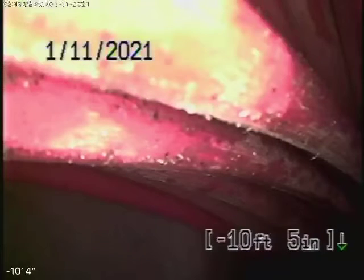We're going to pause and look in the back. It's all ABS back there, so that's all we can check. The unit at the back was built in 1984 and it's all ABS — there's no way to pull the camera in because we can't move the stacked washer and dryer. Have the general inspector check as much as possible. For the main line, we're going to recommend the hydro jetting and we'll stop the recording here.